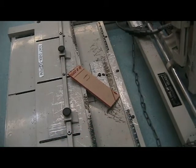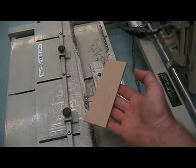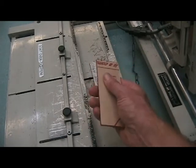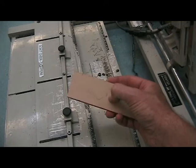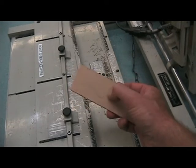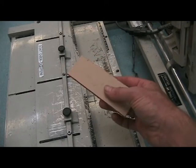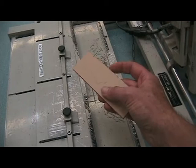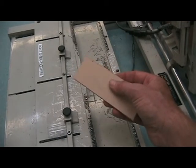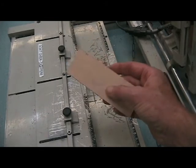This main video right now is primarily intended to show you how to use the engraving machine. We're just going to use a regular old piece of plastic here. One thing that's important to remember when you get the plastic is please don't remove the paper. The paper you want to leave on for as long as possible. It will help protect against scratches, chips, and gives you a better control surface. You'll actually want to leave the paper on until day two when you've sanded, polished, buffed, and drilled the hole. After all that, then you can remove the paper.